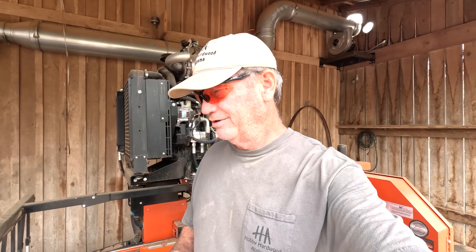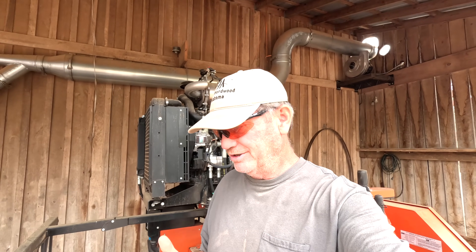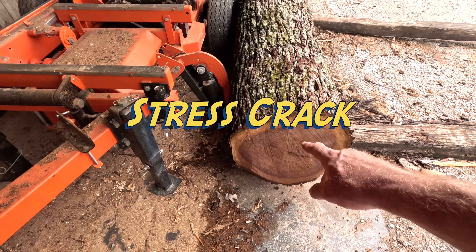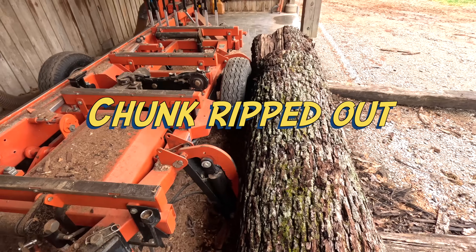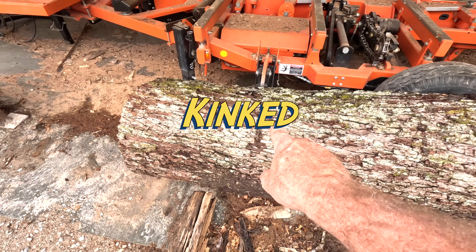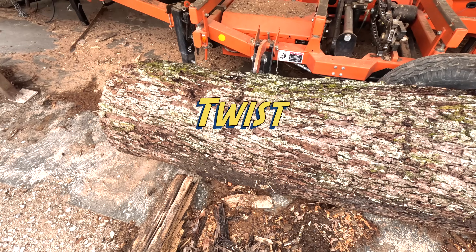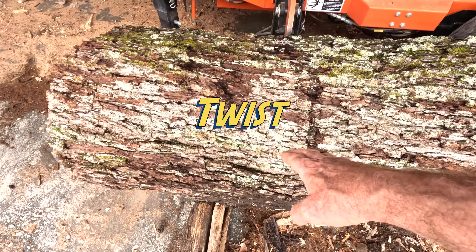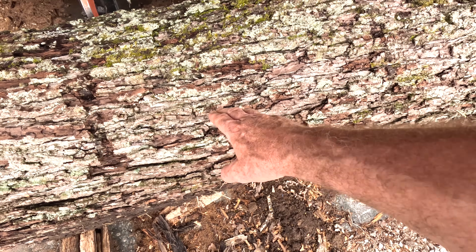The first thing we want to do is figure out what's going on here. You always want to look at the best face — I always saw the best face first, always try to reduce tension, always try to get the most value. This log has one big stress crack, a lot of sapwood, a great bit of defect, a chunk out of it, and if you sight down it, you can see where it really starts to change geometry. It's got a goose egg, and on top of everything else, it's got a twist to it. This is going to cause the boards to warp if I'm not careful.